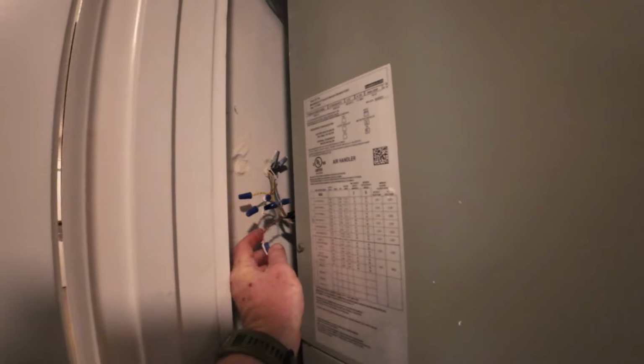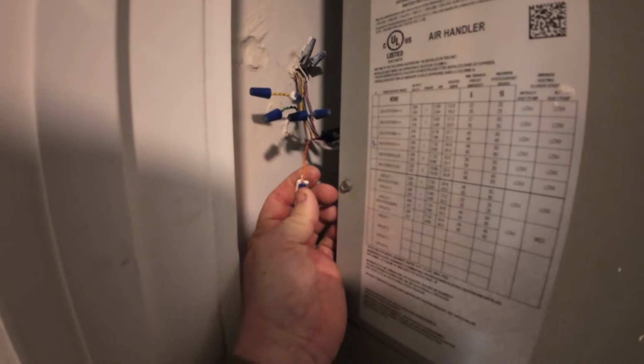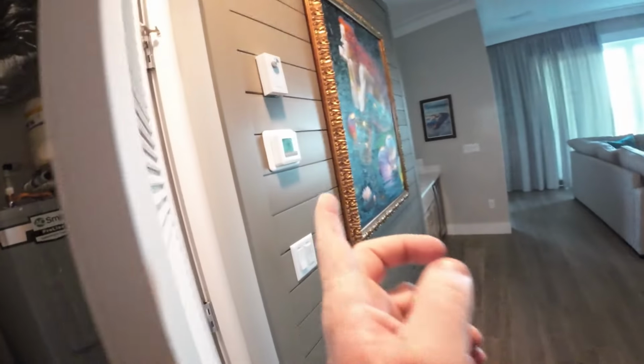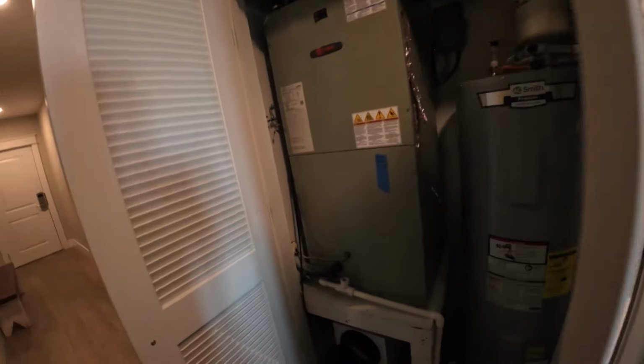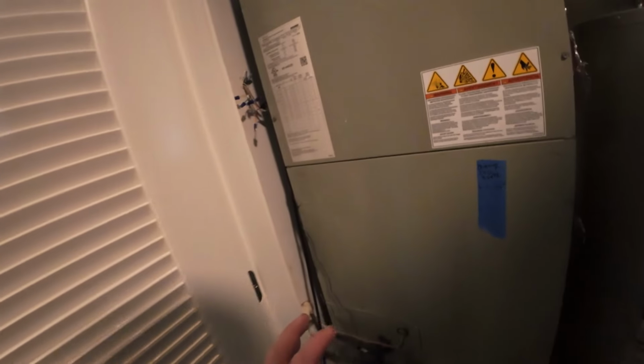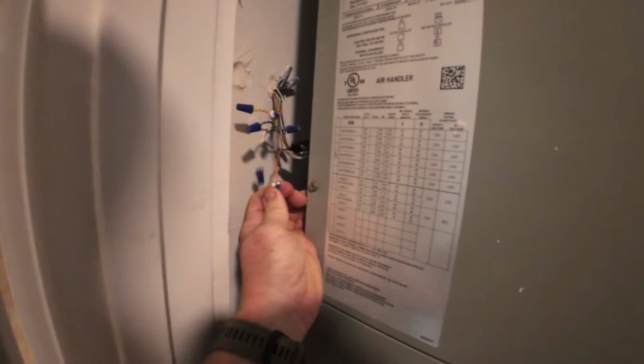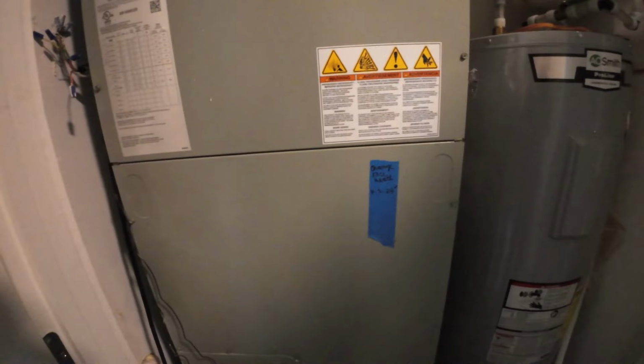So we have voltage here to orange. I'm gonna take this off, check the wiring. We're just gonna check the settings too. We're just gonna make sure, because a Trane is gonna have to get voltage for this reverser valve in cool mode. So it's getting voltage somehow in cool mode. Wire nut just fell off that common. So we'll check it out.